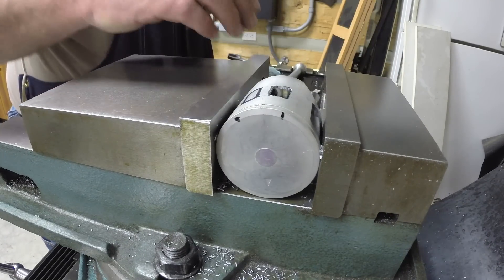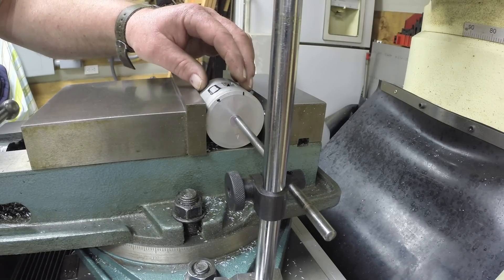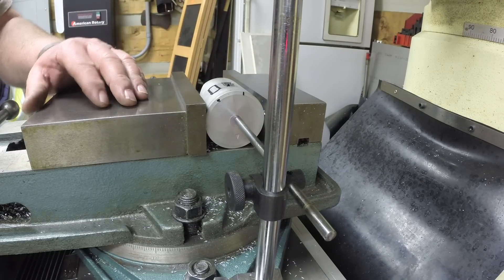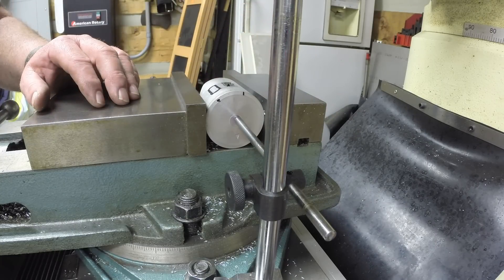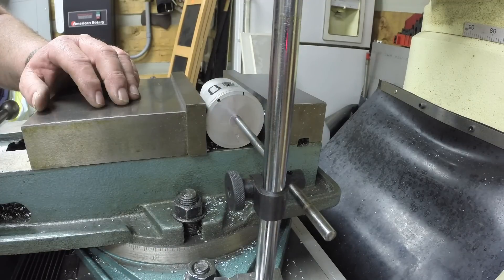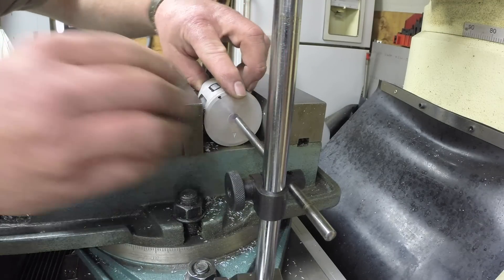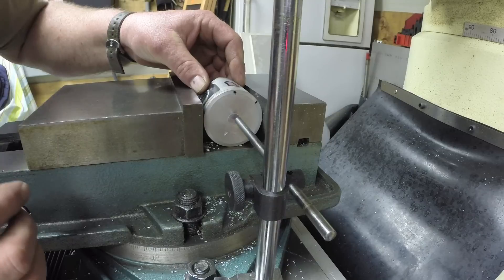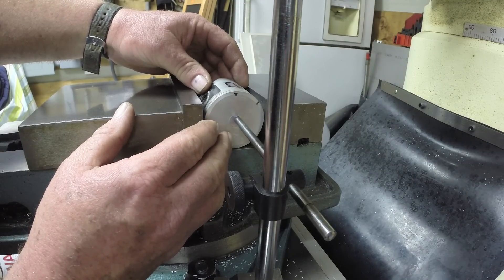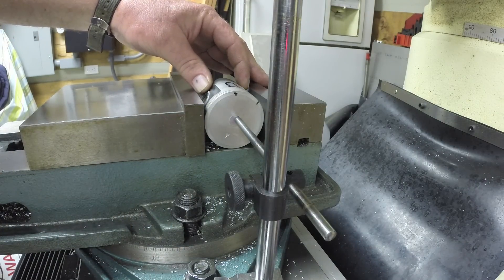I'll be using a manual deburring tool to clean that edge up. I had to get something to make a little stop to make sure I get the piston back in the same position on the X-axis. I don't have a dedicated stop for this vise — eventually I want to make one that attaches to the back like most you see, so I can have a constant stop. What I'm using is a mag base — an indicator magnetic base with a rod sticking out — just holds it just enough until I get moved, then I move it out of the way once it's in place.